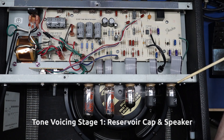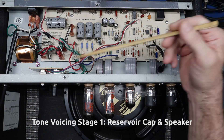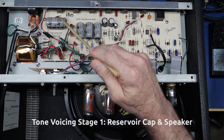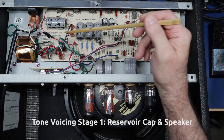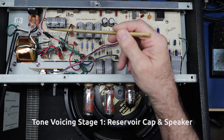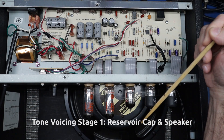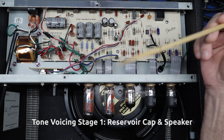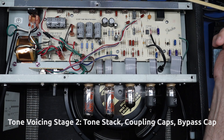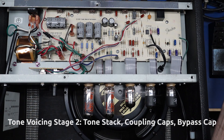The speaker swap is a little more subjective, but if you change the speaker and put a 100 UF filter cap there, it can be done at the same time as the stage one maintenance. Those are relatively low-hanging fruit and very impactful. Stage two for voicing would be changing the coupling caps — in this board that's C2 and C8.